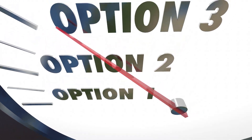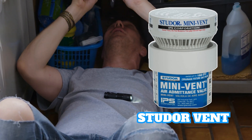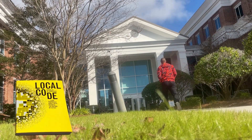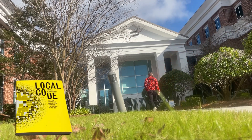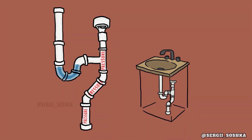As an alternative, you can go the easier way with installation of an air admittance valve, also known as a Studor vent or mini vent. However, you might check with your local codes whether it's permitted in your municipality, as a stack vent is often required by code. An air admittance valve allows air to enter the plumbing system to balance pressure when it develops due to the flow of water or gravity, and prevents siphonage of water from the trap, which blocks sewer gases from escaping.